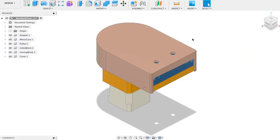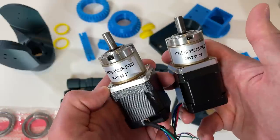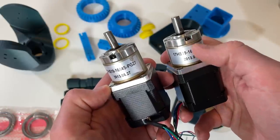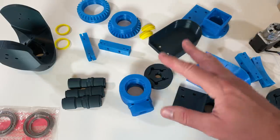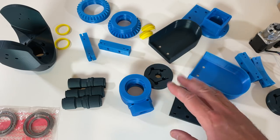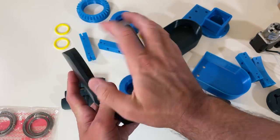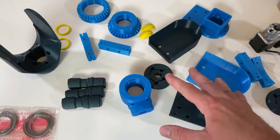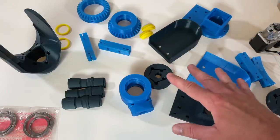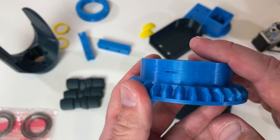Now it's time to start the assembly. These are the 3D printed parts we're going to use, and these are my stepper motors with planetary gearboxes. All these parts were 3D printed in the orientation they are now laying on the table. This is a big part for the wrist — really huge, 22 hours of print. I used standard settings and support only on the build plate. Before starting the assembly, I need to clean the parts.